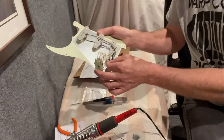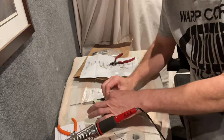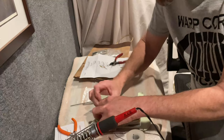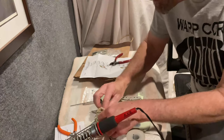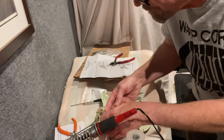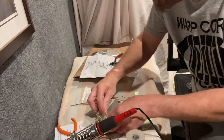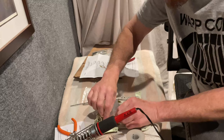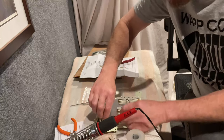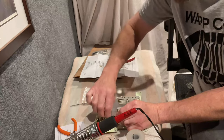With the cloth wrap, you can just push the wrap back over if you had pushed it back. Now carefully bend this down and get that down here so they all kind of follow the same path. Looks pretty good. All our pickup leads follow the same path. You can see there's enough cable that if we need to make any adjustments you can, but it's not so much that it's creating a mess.